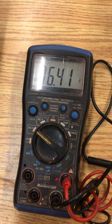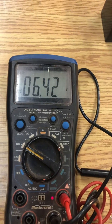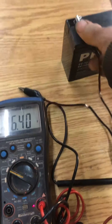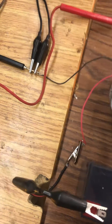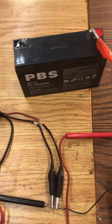Quite interesting technology. Again, you can see we're up to 6.40, 6.41 — we're going to apply the current. The motor, because they're properly phased, doesn't see the work — it's going to spin no matter what. That's the cool part of this technology. Again, 6.42, and clearly charging the battery. If I take the load off — which is the battery — instantly the speed goes higher, and then I can accelerate it to show 24 volts. We can shut it off and measure the battery voltage: 6.40 volts. It really doesn't use that much power, and substantially charges that battery.